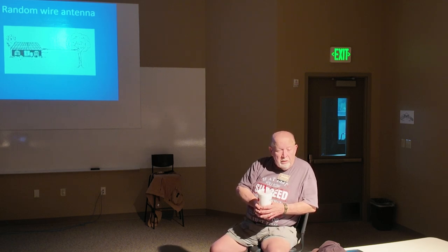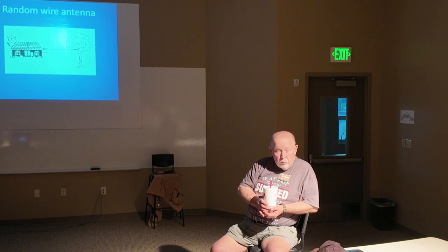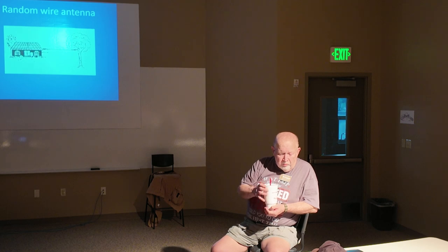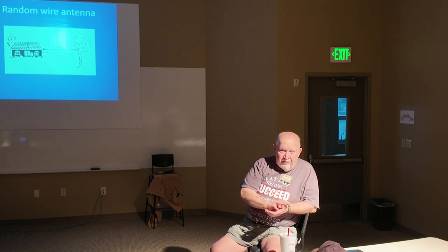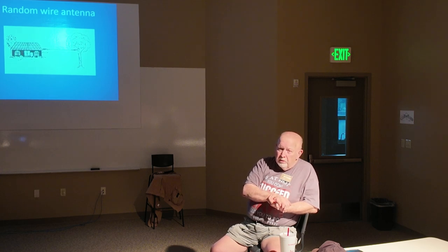Most of our transmitting that we do on the Mars frequency is on a 7 megahertz frequency, so we don't use the wires anymore. I could take them down, but I decided that we have so many other frequencies. Our particular wing has five frequencies from 3.3 up to about 16 megahertz that they could have us on. So I kept the wire so we'd have something to transmit on if the beam wouldn't work,